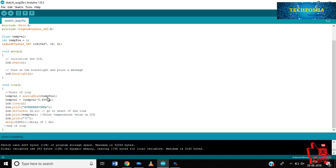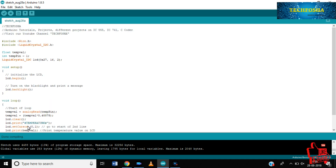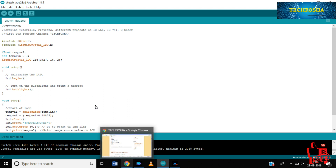The main code is in the void loop. We take the output from the LM35 sensor into tempVal, then multiply tempVal by 0.48875 to convert the analog reading to degrees Celsius, storing it back in tempVal. We use lcd.print() to display the label 'Temperature', move the cursor to the second line, then print tempVal in degrees Celsius. Finally we add a delay of one second. It's a simple program.